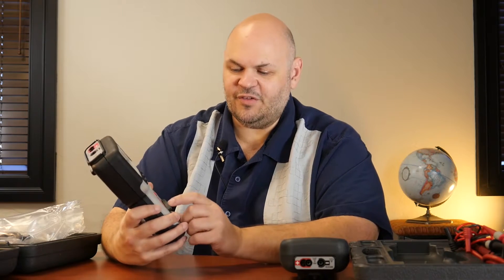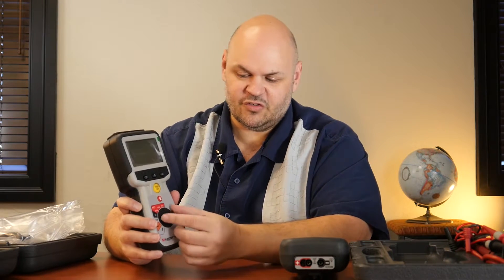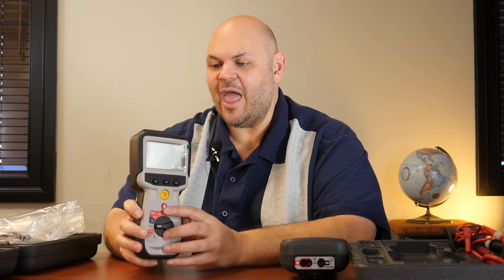The differences between the series within the 400 family — the most important is the voltage ranges. The MIT 400 has three ranges: 250, 500, and 1,000 volts — basically just turn the dial to get your right voltage. The higher-end units, the 410, 420, and 430, all have five voltage ranges: 50, 100, 250, 500, and 1,000 volts. They've also made the output voltage much more stabilized, so you'll be more accurate in knowing that the voltage you're getting out is the actual voltage you're testing at.